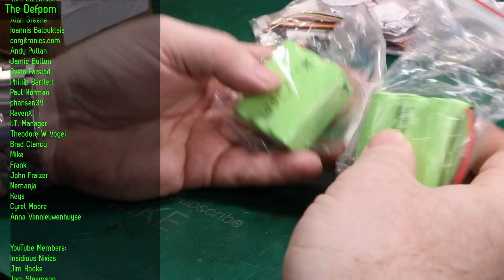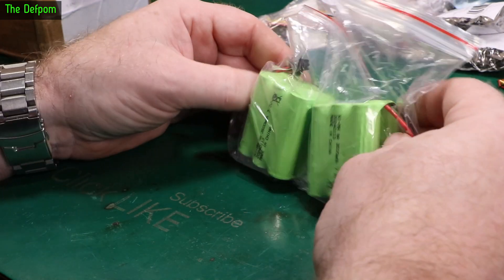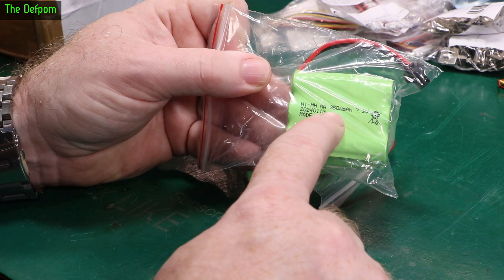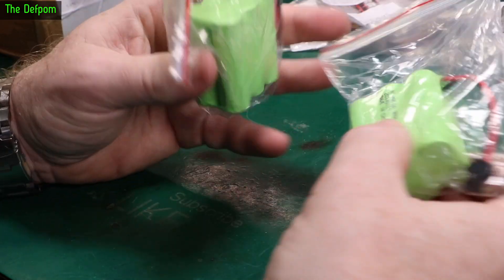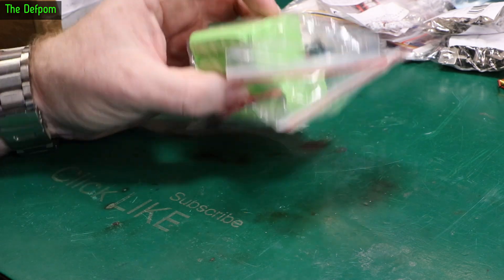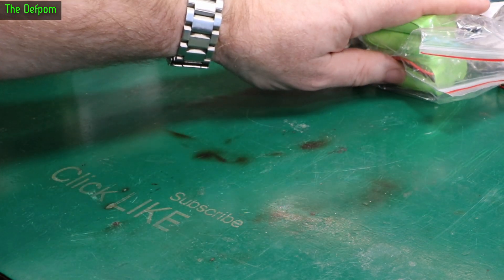I showed these before in a previous mailbag and I used them, so I've got some more. The amount of times I've actually needed to have batteries like this in repairs and projects — I just like to have them on hand. So these are some nickel metal hydride 3.5Ah 7.2 volt packs — six cells in there, and a pair of them. I actually used a pair of these recently in a project to create 14.4 volts, and it worked beautifully. Now I've got even more spares — I like to have spares. If you've watched my channel for a while, you know you always need spares and redundancy.